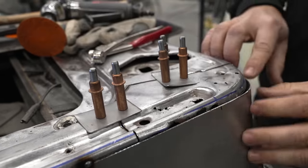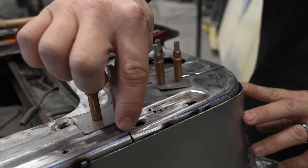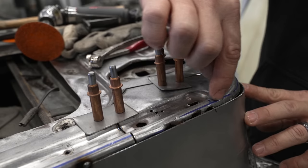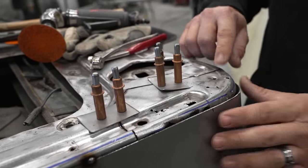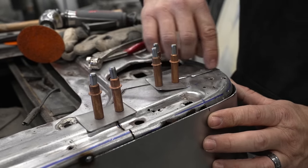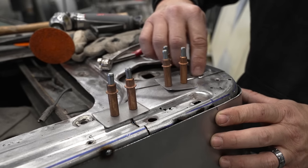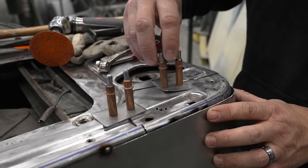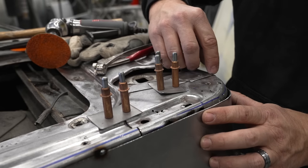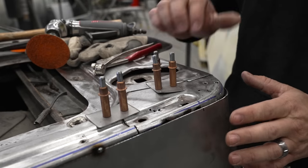All I need to do is get the depth off of this radius, and then I also need to mark on the tape the radius in which we are going to bead roll this into, as well as capture these lines. Now, because we have the ability to cut and straighten these lines up, we can do that and still be able to locate this in the same spot as long as my tape template goes exactly to where the distance is of the new cut line.